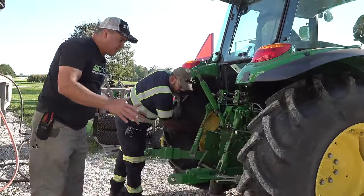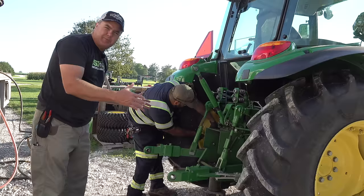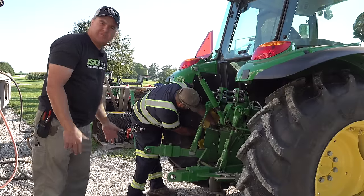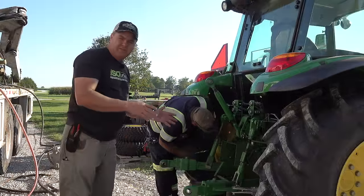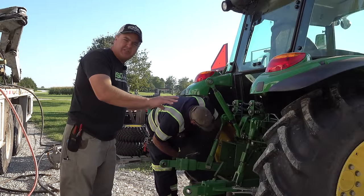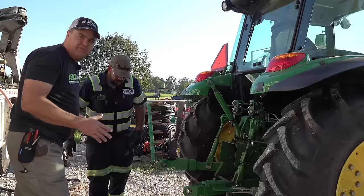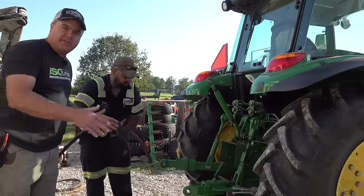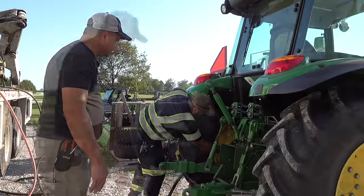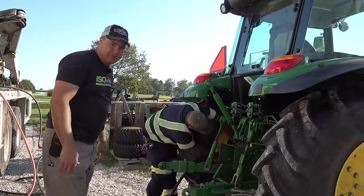There are either four or eight different positions for these tires being in or out, and depending on which position we've got the tire in, the valve stems will be on the inside — that's what we've got here. I moved these tires outward one setting after we got a couple of other attachments because it was kind of tipsy, but I still wanted to keep them in far enough to go down 30-inch rows in case I went to the family farm for row crop work. I think it'll be less tipsy once we get the RimGuard in.